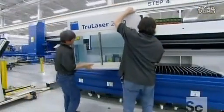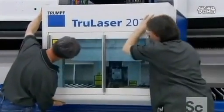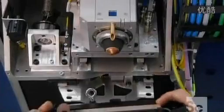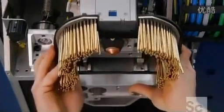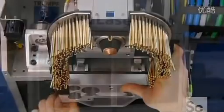After testing, they enclose the cutting head with a safety cover made of sheet metal and plexiglass. The cutting head's copper tip nozzle emits the laser beam, while a curtain of brass pins confines that beam to a restricted area.